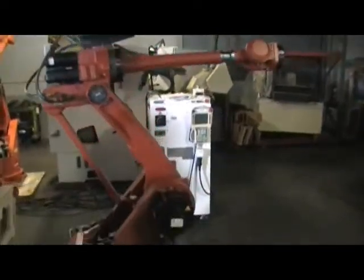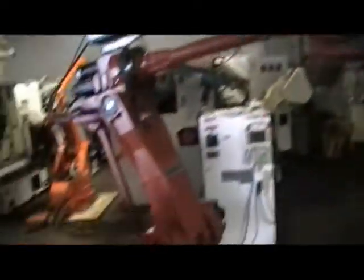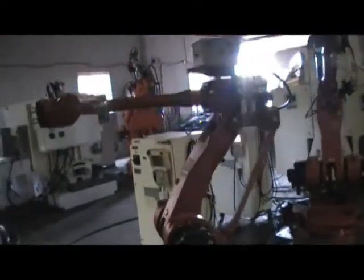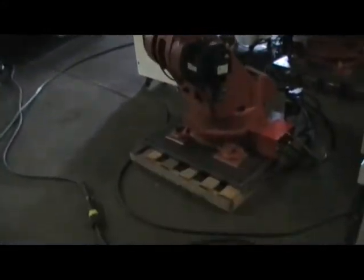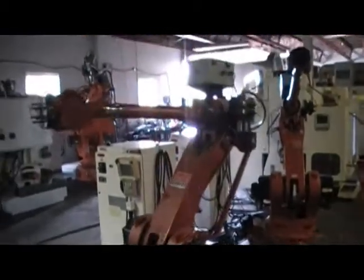Usually with 50 kilograms, because SC50 means it can handle up to 50 kilograms on it. The regular speed for movement is 1200 millimeters a second, but they will go up to 5000 millimeters a second if you need it. We just have to mount it and bolt it down very well, and that's it.